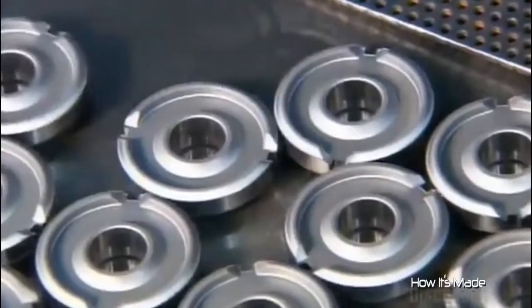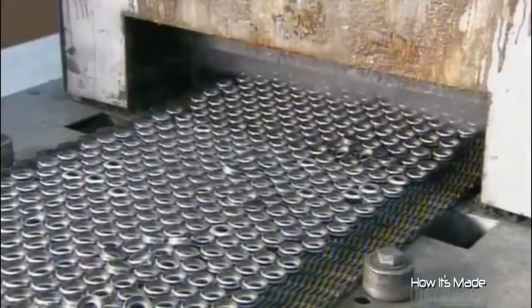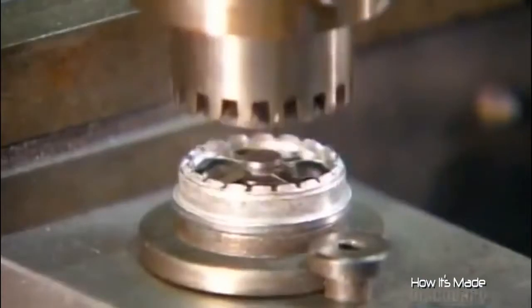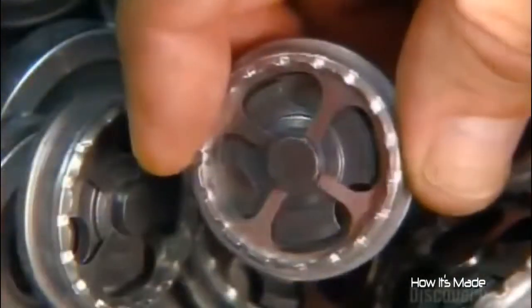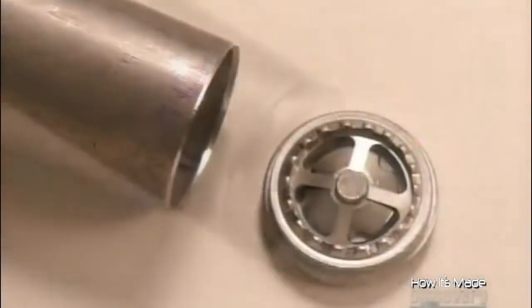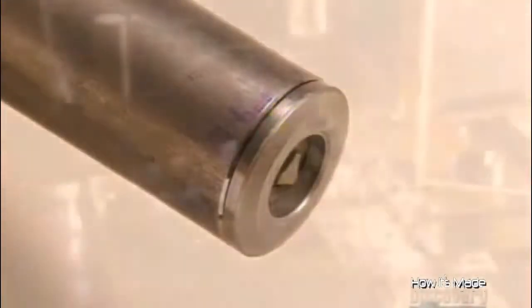Many components are made of powdered metal, mostly iron powder mixed with some graphite and copper. After a press compacts the powder in a die, a furnace fuses the particles. This powdered metal part is the valve through which the piston forces the oil. Steel discs and a spring help control the speed with which the valve operates for varying driving conditions. A stamping tool crimps the end of the tube, holding the spring in position. The valve, now fully assembled, seals the bottom of the pressure tube.